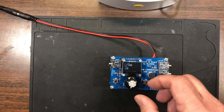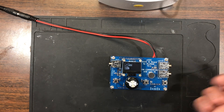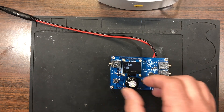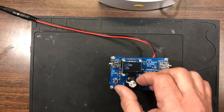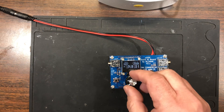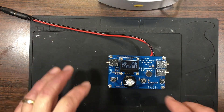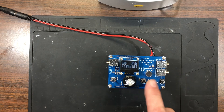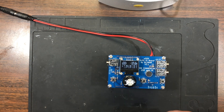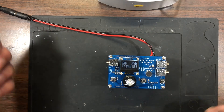It's pre-configured to cover from six meters to 160, but because we can only do eight bands I had to choose which ones to include. Let's go back to 40 meters and select that. You do need an amplified speaker if you're going to listen on a speaker, or you can plug in headphones. The neat thing I really like is that Manuel put in his own built-in microphone, so you don't need an external mic. You can hit the push-to-talk button and speak right into the element, or plug in a hand mic where you'd plug in your key, and use push-to-talk from up top.